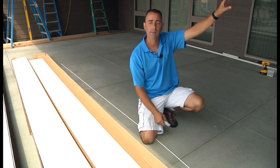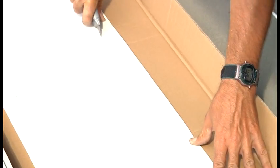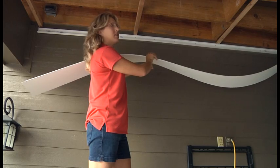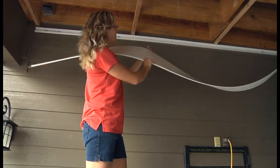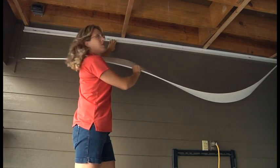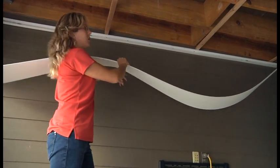In order to not end up with a really small panel or a one inch rip at the end, we're going to cut an inch off of this panel to alleviate that. Now that we have our wall trim up, it's time to install our first panel. We're going to start with the end we already cut because that's going to slide easily into the lip of the wall trim.